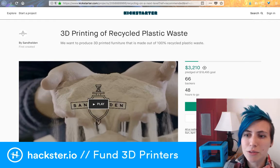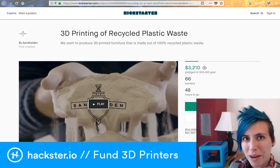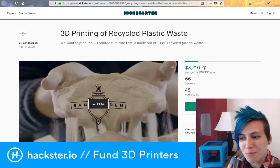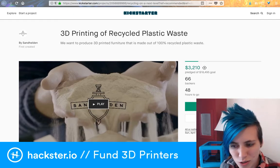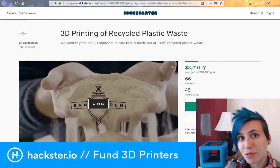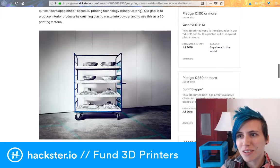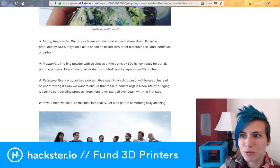And then there's a swiper that swipes a new layer of powder on top, because the bed that provides the powder gets lifted up a tiny amount, and the print bed where your thing is being built gets lowered a tiny amount, so that when it swipes over, a thin layer of powder is transferred over. I'm assuming that's how they're planning to use this, but it's kind of cool to just see the different types of 3D printing that people are trying to develop with this recycled material.